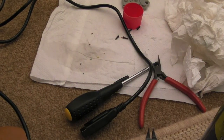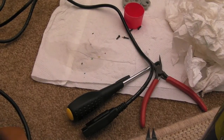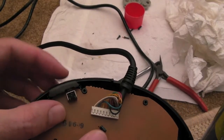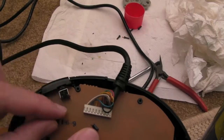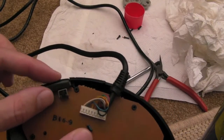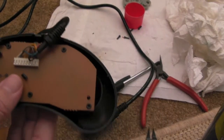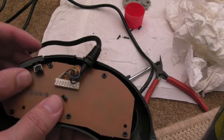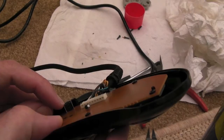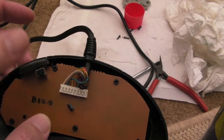You can see these have got the mode button — I'm not even sure what they're used for, it's that long since I've had a Mega Drive — but you can see the button is just not doing anything. There's no sort of spring or micro switch left in there; the contacts inside have just gone. I've got a replacement — they're just little 6mm square micro switches. I've got one of those and I'm going to replace that.